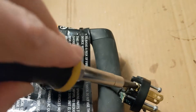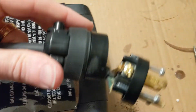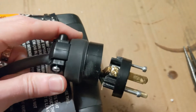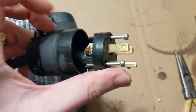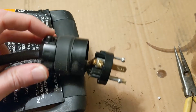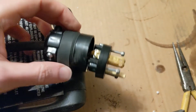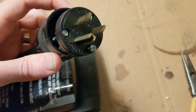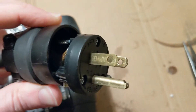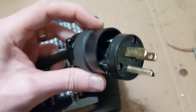You can loosen these up and basically just tighten that down and then it's all good to go. If you wonder where you get one of these replacements, you can get these at pretty much any home store — Home Depot, Lowe's, Harbor Freight even has some. Just look for something that looks fairly robust. Make sure it's one that's rated for the full 15 amps of most circuits. I got one with a little rubber spot to pull — nothing really fancy. I believe this is the Leviton brand, which is fine and very common, you can find it in most stores.